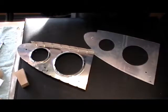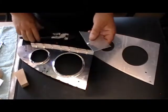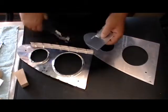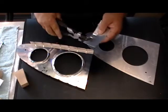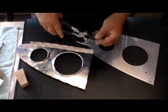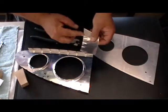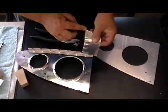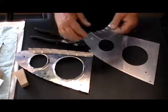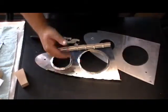I will demonstrate. Non-fluted — put them in the pliers, give them a squeeze — fluted. Notice when I did that the material kinked up; if I continue to flute along here I could actually flute this piece into a complete circle. The reason it's arcing up is because I'm shrinking this edge — this point and this point are getting closer together, and they curve around. That works to an advantage because when we're arced the wrong direction, we take the fluting pliers, take up the material, and that allows us to continue to bend over 90.